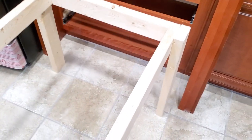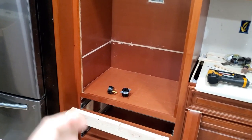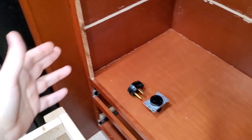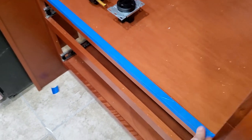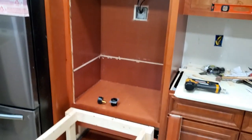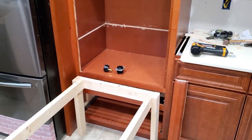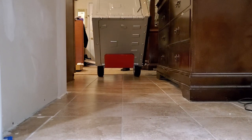Another thing, when you try to hold a super heavy oven, you have a chance to hit your cabinet on the bottom. You're going to put a lot of scratches with this type of deal. I'm also going to put some blue tape right here just to make sure I'm not going to scratch anything while I'm inserting this oven. But basically, this is how we're going to do it, and this is how you install those wall ovens into this cabinet. I know the video is getting pretty long, but I just want to make sure I cover all specs, so you know what you're doing while you're installing these types of cabinets.